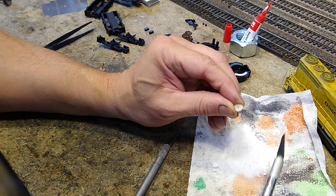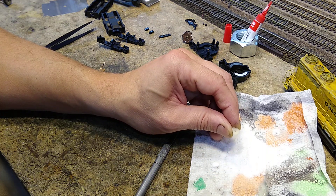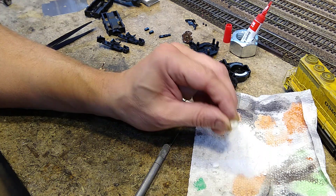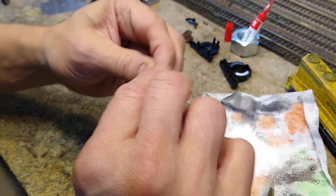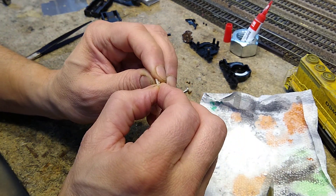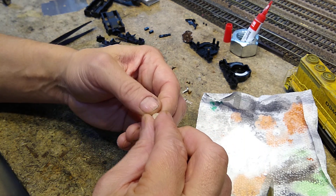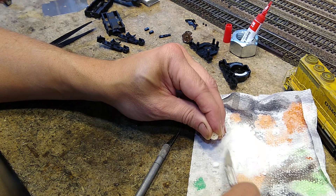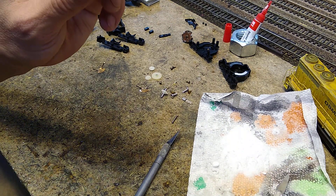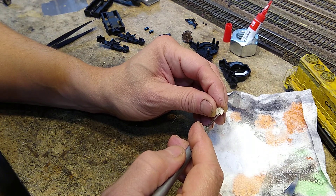Now we've got them. Let's just wipe them off. Let's take this baking soda. This should give us a super nice, clean solid bond. That looks like what we've got, and I think we got it. We're just going to put a little bit right there — not too much, because we don't want to have to file out excess baking soda, as it makes a super hard resin. Let's take a look. Looks good.